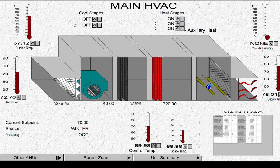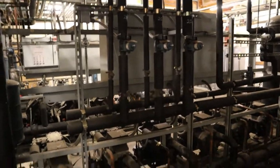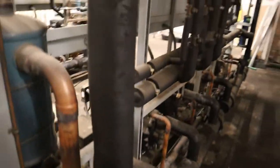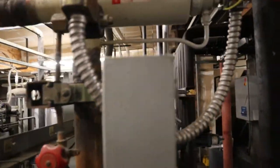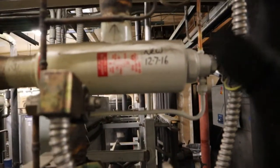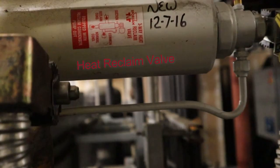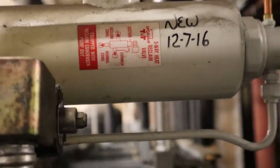Here at the store showing you rack one — this is stage number one. You can see on the discharge header going to the separator, from the separator going up to the three-way valve — the heat reclaim valve. There you go, you can see which direction it's going for each line.